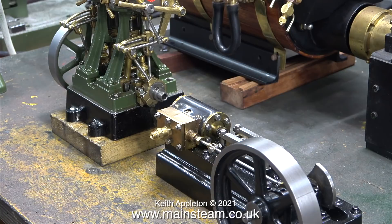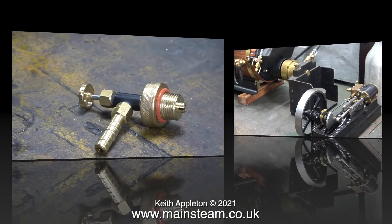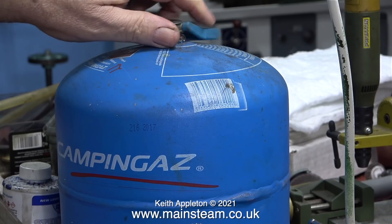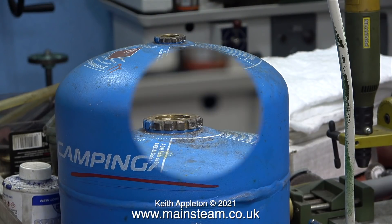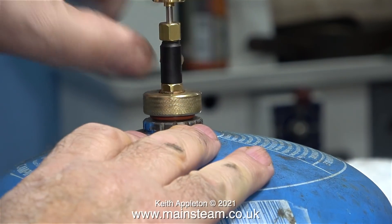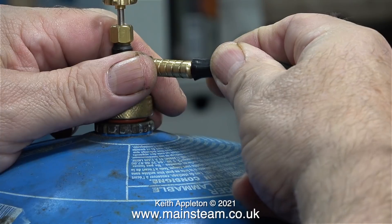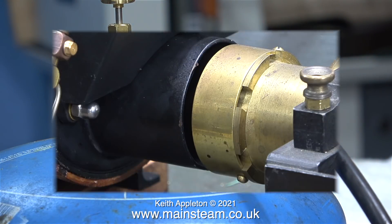In this episode I'm going to be testing two steam engines — here they are: the Stuart Double 10 V and the Stuart S50. I found my gas tank adapter that I made; it has a 16mm thread and fits a camping gas cylinder. This is just butane, not a butane-propane mix, but as the tank is large it's less prone to chilling and the pressure is perfectly fine for raising steam. Here I'm connecting a piece of silicone rubber tubing which stretches over the outlet pipe easily. Time to light the burner.